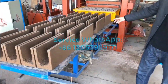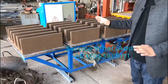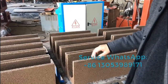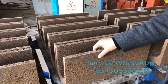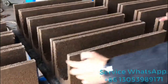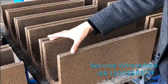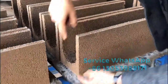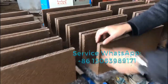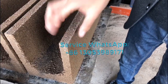So this is the final product. It's very beautiful. This water channel brick was ordered by our old customer. You can see this design — the length is about 500mm, the width is 150mm, and the height is only 200mm. The thickness of the wall is very small, it's only 20mm, so it's a little small.